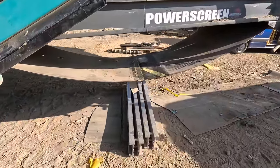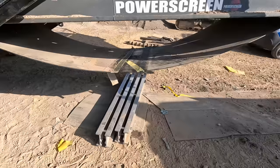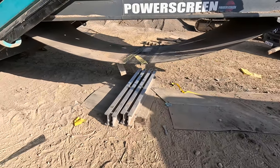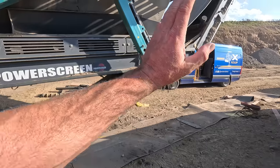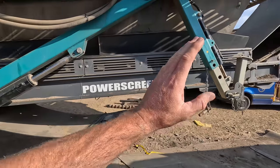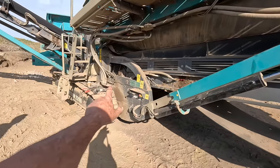So what we say now, Bob, just pull that bit of tape off. Don't leave it on that, just trim it. Trim the joint up and that's it, is it? Let it get down to room temperature. You can drop the conveyor back down here now. Yeah, we'll put a bit of tension on and that. Then we'll put some tension on the tail drum.